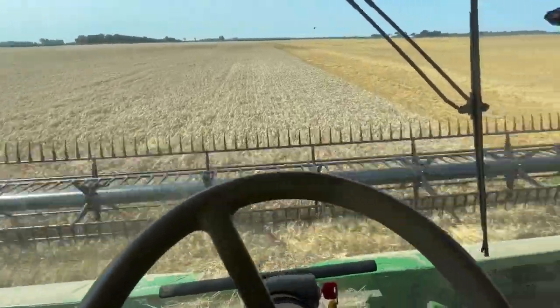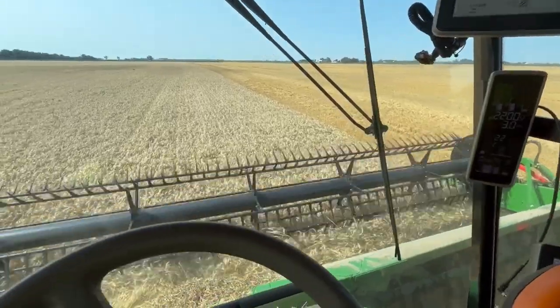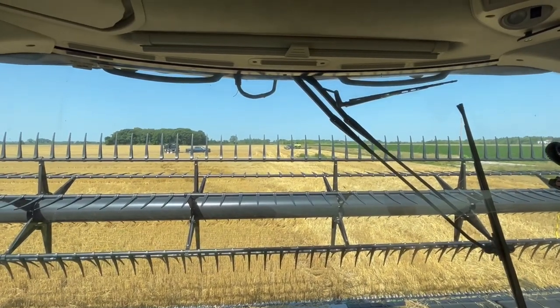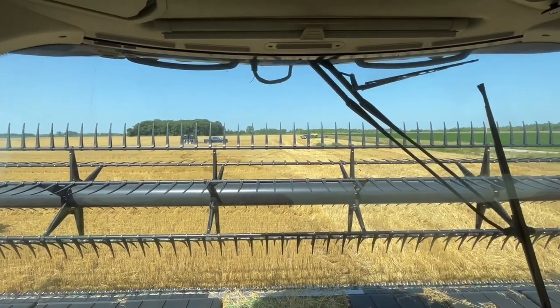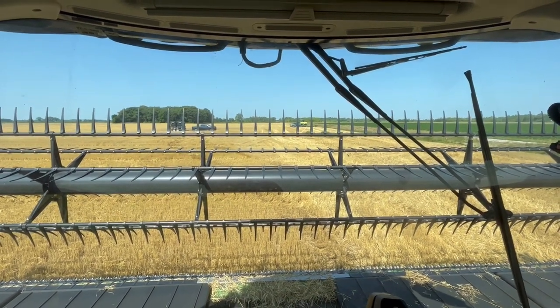While he's doing that, I'm going to get the combine fired up and maybe dive into the wheat to make sure it's dry enough this morning. That way we can keep moving. I'm saying 13.2 — that'll work. Well, Dad's back with the wire. The moisture did pick up; it must have had a little bit of wheat left from last night. It's up to about 15.4, so we might want to hold off a little bit.